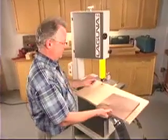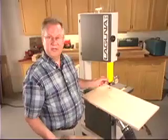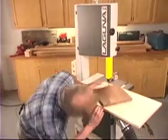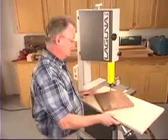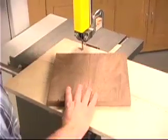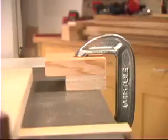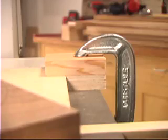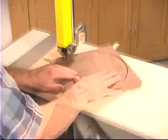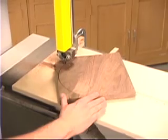I have to move the jig back. We're going to cut a 10-inch diameter circle, so I'm going to put the pop rivet in the hole for the 10-inch diameter circle and mount the workpiece. We're ready to make our cut. I'm going to advance the jig to the stop block and then rotate the workpiece.